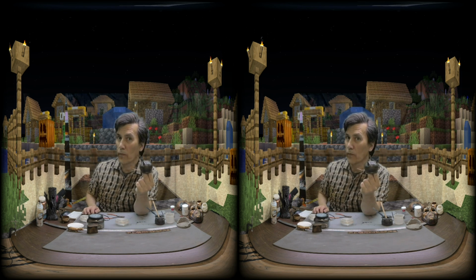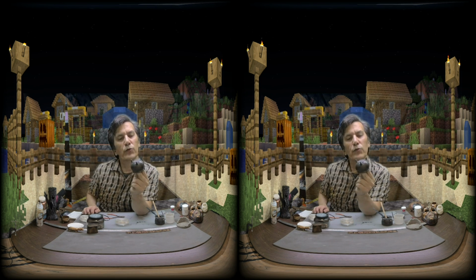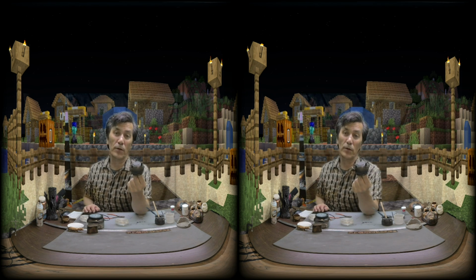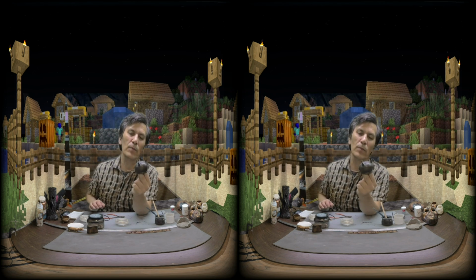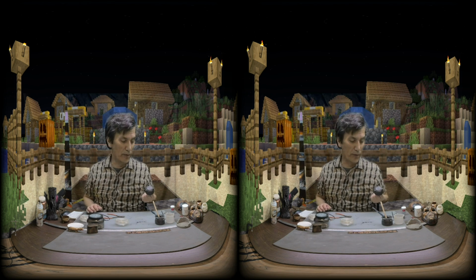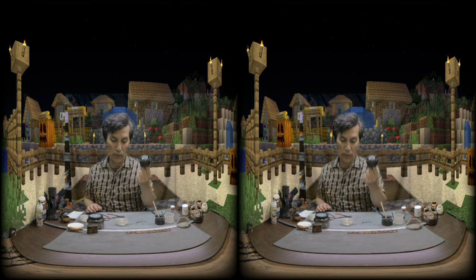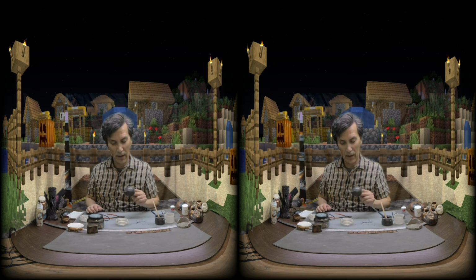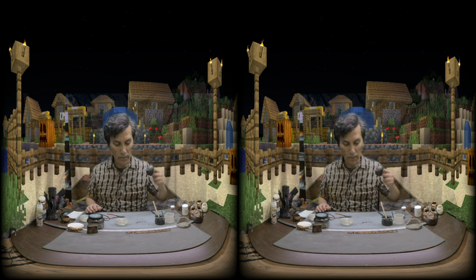We never go over 4.5 volts. That's where we set it. And this will probably be between half an amp to 1.1 amps. Depends on your formulation and application, but around 1 amp for one of these. So if you have a small 5 amp rectifier, you can probably throw in a batch of 2, maybe 3, and these come out quite well.